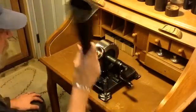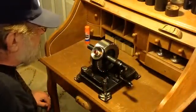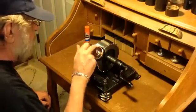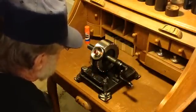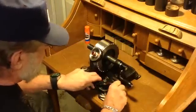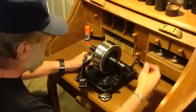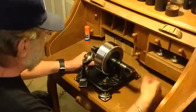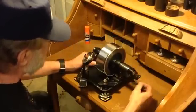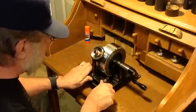All right, so over the next few days, I'm going to be changing the stylus to a standard needle stylus rather than a blade, and I'm going to change the gaskets from paper to polymer. I will also be doing some recording on other types of foil — brass foil, copper foil, lead foil, and of course original tin foil. What I'm recording on right now is one mil aluminum foil. Just another quick experiment with the tin foil phonograph.